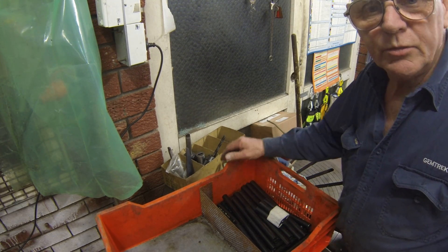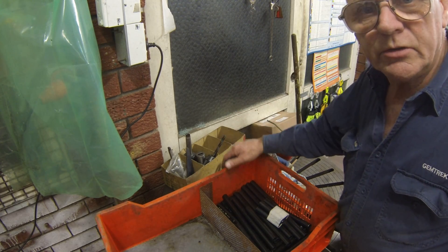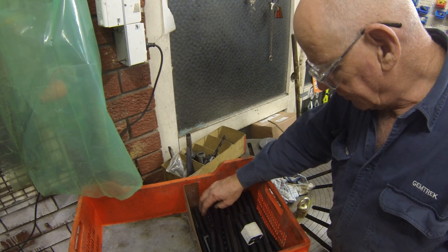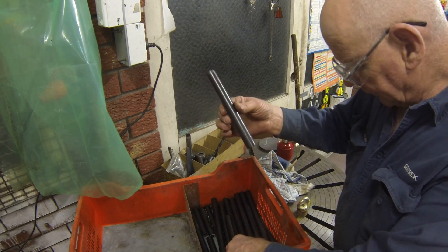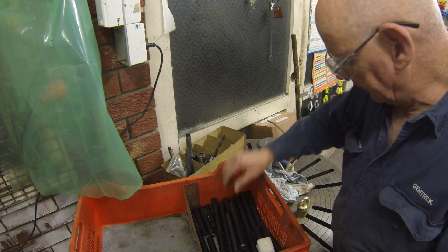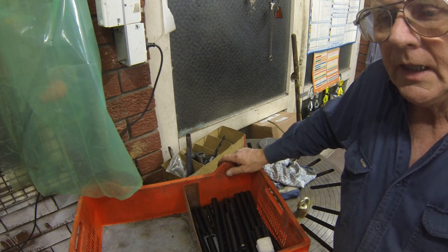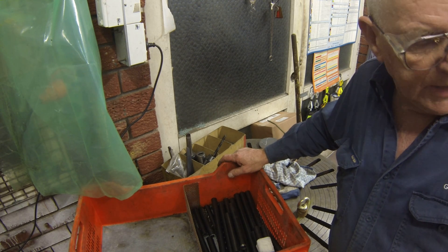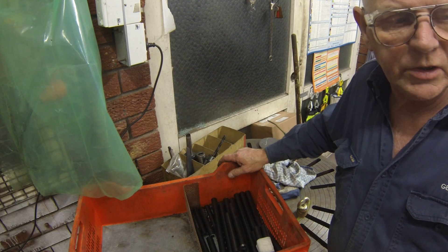Good evening, this is Bruce and welcome to my shop. This is the last in the series on the adapter for the geometrical die head. The reason I've got it all together is because I got an order to do 40 of these pipes of varying sizes — half inch steel pipe, medium weight. Rather than hire a threading machine, I decided to use my geometrical die head that I'd never used, picked up at an auction. The series up until now has shown me making the adapter to fit in the tailstock.